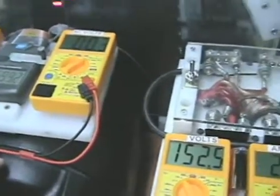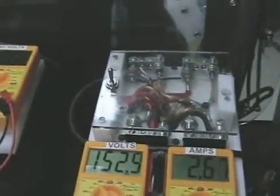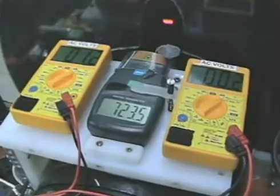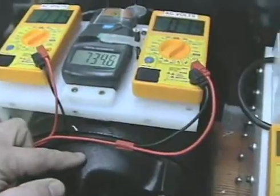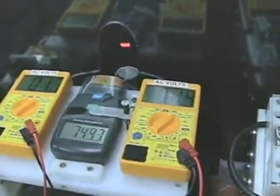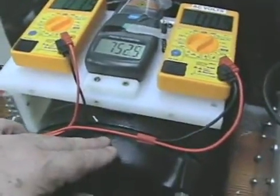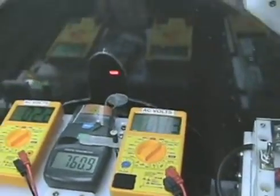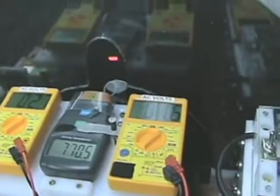The plan is for the induction generator to start pumping the caps up, and then use the caps to drive the pulse motor. Optimally, I'd want some type of rotaverter circuit to spin the motor, get the wheel up to speed, and then kick that off — that would be your starter. You'd use the AC motor to start the wheel moving, and when it gets up to speed you switch it over and turn it into a generator.